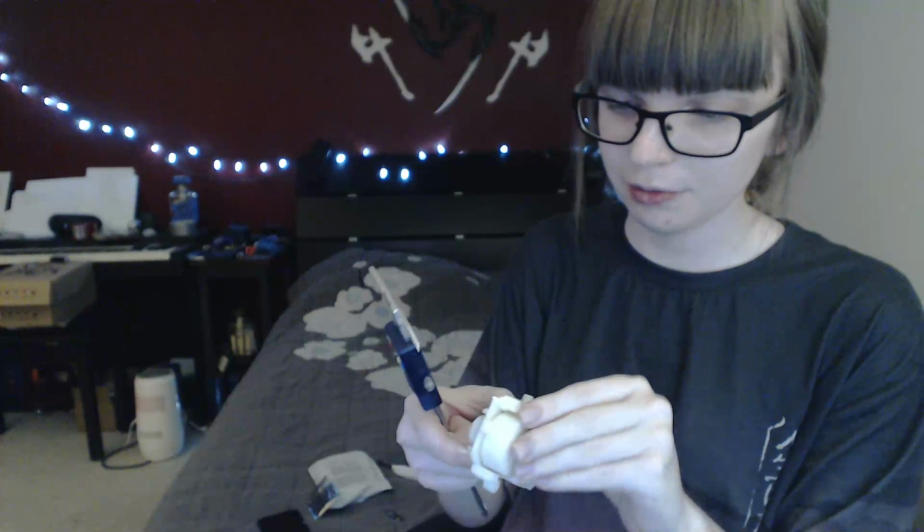Alright. So what we can do to try and find a center reference here is we can actually measure the diameter and then... Yeah, okay, so this is 21 millimeters, pretty much dead on. So half that is going to be 10.5. So we're gonna find if this is 10.5. It is! Okay, so we have a center reference here, which is really good news. So okay, let's go back in time and we're gonna mess with the Korg.